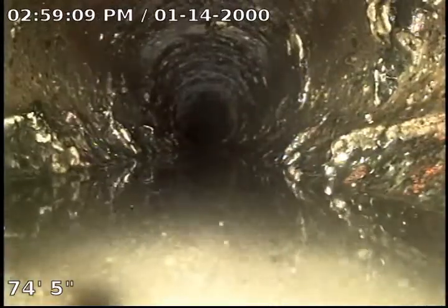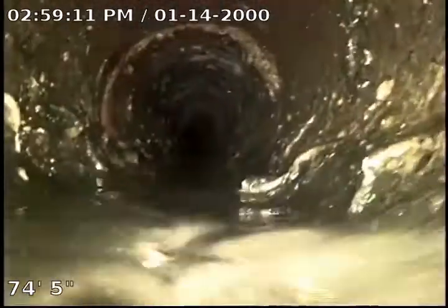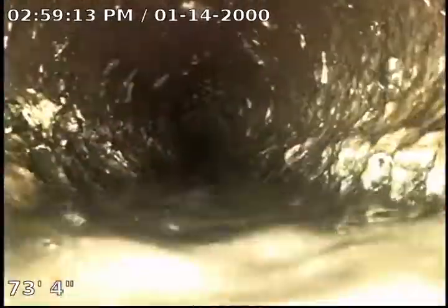You can see here I do have some standing water and some sludge buildup on that bottom side. What Bio One is, it's live enzymes that we put in the sewer — it needs to sit inside your sewer four to six hours and it helps eat away any of the sludge buildup. You can see there, I've got a little bit of a belly as well.